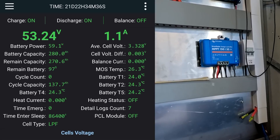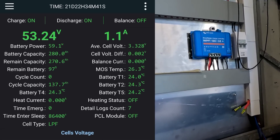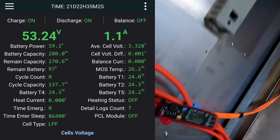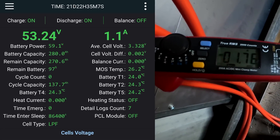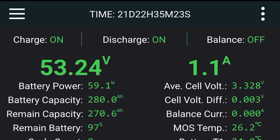The inverter has now turned off and we are recharging the battery with the rooftop solar. You can see 1.1 amps the BMS says coming in, but asking the clamp meter it shows 1.7 amps — quite a bit of a difference. JK has also advised to use as high a current as possible, so you cannot actually calibrate your BMS with 1.1 amps. If we type in 1.7 amps, we see the app doesn't allow any numbers after the decimal point — only full numbers.